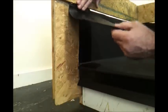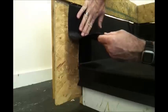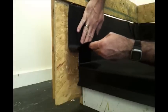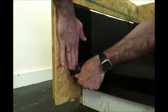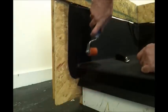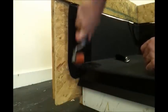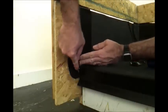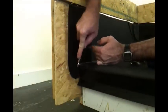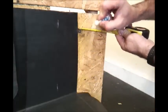Once the backing paper is removed from the Quick Seam Foam Flash, it can be offered into position. Start from the top and work your way down — it will shape and mold into place when it reaches the roof deck. Finish off with the silicon roller and the penny roller, then it's a simple repeat operation for the other edge of the wall.